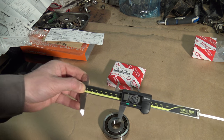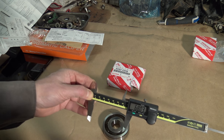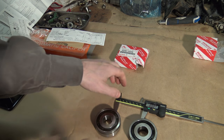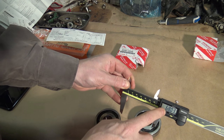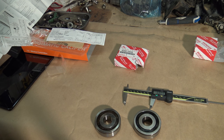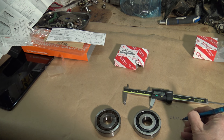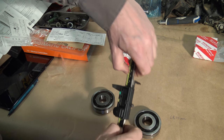It is 68.03 millimeter. Okay, good. And then, because I have a similar old bearing, I'd like to check whether it is really the same as the old one. This was 68.03, and I write this down on my paper, 68.03 millimeter. Okay, good. And then I measure another one, which is also similar, and I insert my